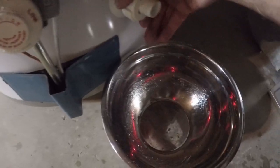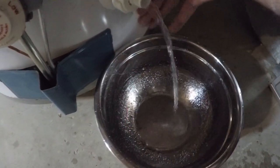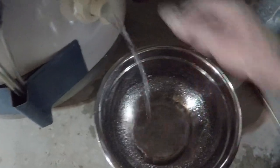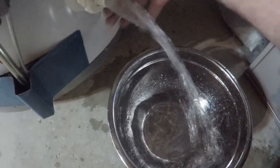The other thing you can test is the lower drain valve on your hot water tank. This will also help get some of the crud that accumulates at the bottom of the tank out of it. There is a hose fitting so you don't have to catch it in a pan. Once I got the water off the bottom of the hot water tank, I threw that down the hole as well.